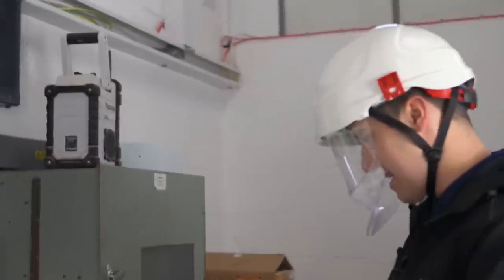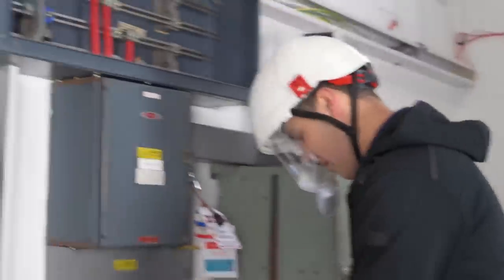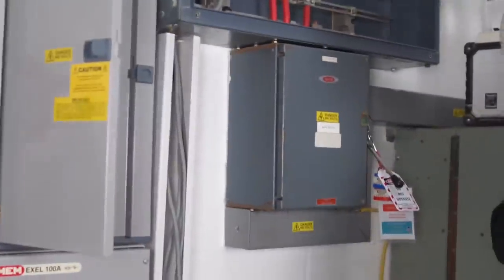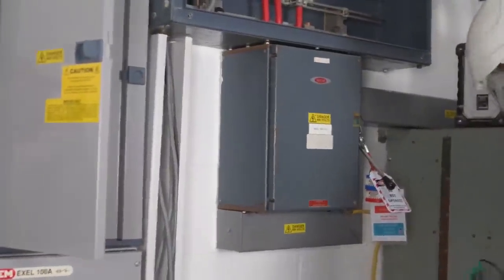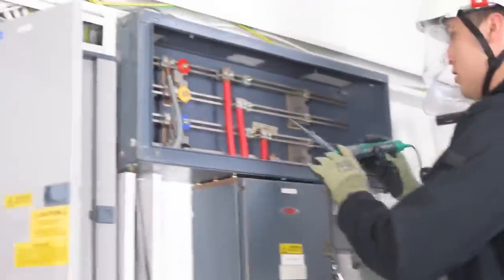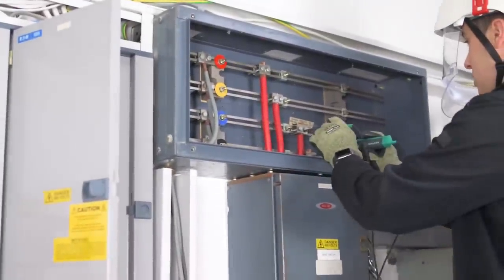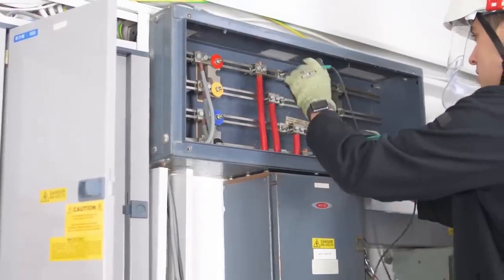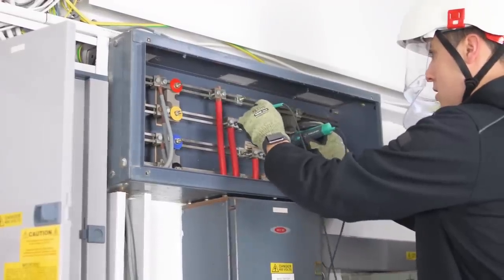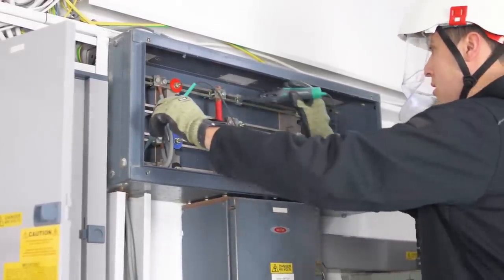So, Corey, flash bang gear. I think that's it. Yeah. Arc flash headset on. Yeah, I mean, just in case. So this main switch underneath here, this is a 200 amp switch fuse, and Corey has isolated it, but he has to do safe isolation to make sure that the busbar is dead. So he's got his proving unit, and then he's just going with his GS38 test leads, checking all combinations to make sure it is actually dead.